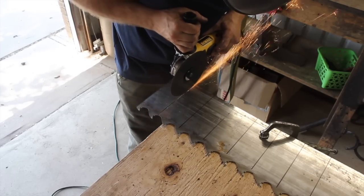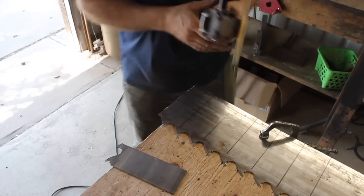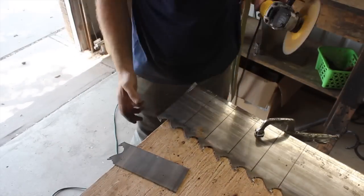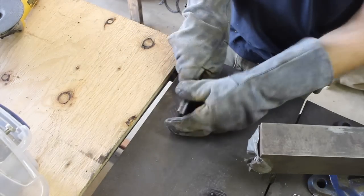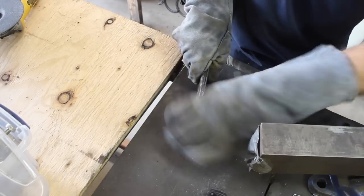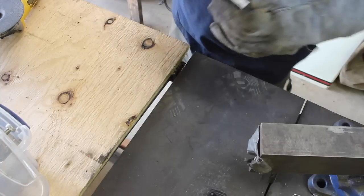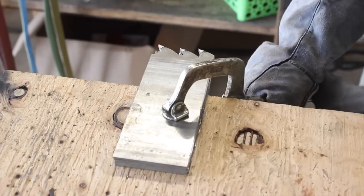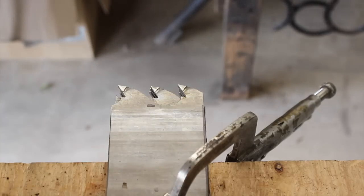Currently the best way I have to cut this up is with the cutoff wheel on the angle grinder. That particular cutoff wheel is about 40–45 thousandths — not sure exactly, but right around there. The thicker your cutoff wheel gets, the less effective it is — more surface resistance. A plasma cutter would be pretty nice too, but this works fine. Something to take into consideration when using reclaimed steel: even if it's free or much less expensive than new steel, you have to account for the time and effort required to prep it for your project.